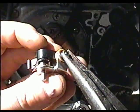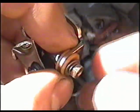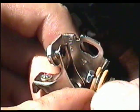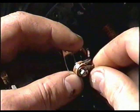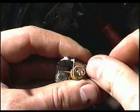Now we're ready to install the points. Just loosen the nut on the points a bit — don't take it all off. Insert the wire that goes on the points in behind the flat washer. Do not put the wire on the metal of the points; there are two pieces of plastic that prevent it from shorting. Put it in like this, then tighten up the nut.